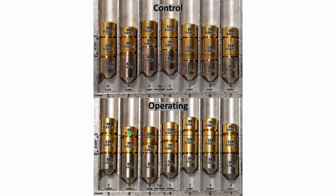Now notice how close it is to hit the control shear line. In this case it's really close. It's only 12.5 thousandths. I could go into that detail because these pins and wafer segments are in 12.5 thousandths, but we always pin the lock 2 steps, so we pin it at 25 thousandths. So at 12.5 thousandths, the shear lines are too close.